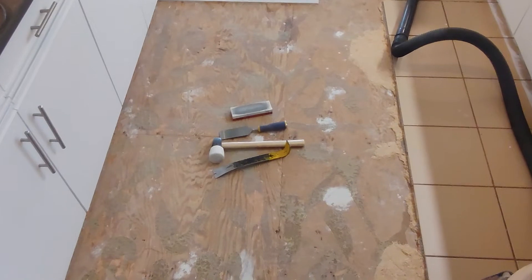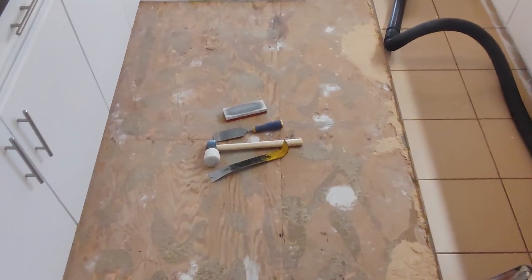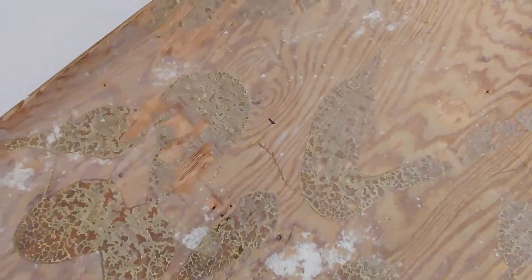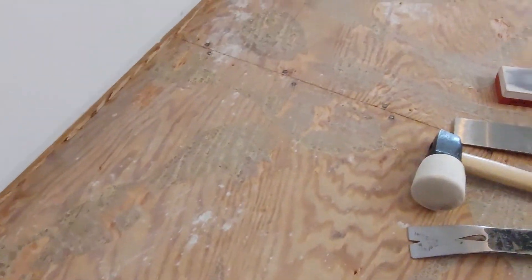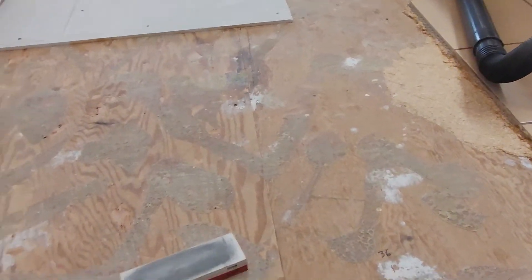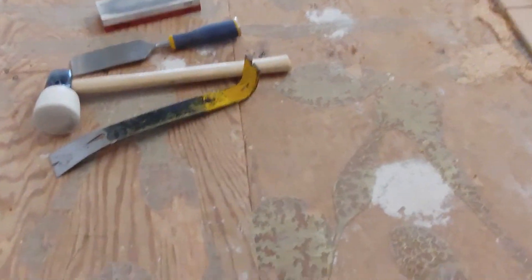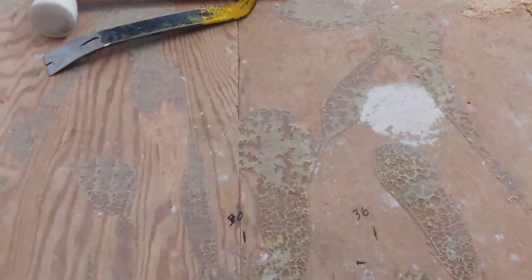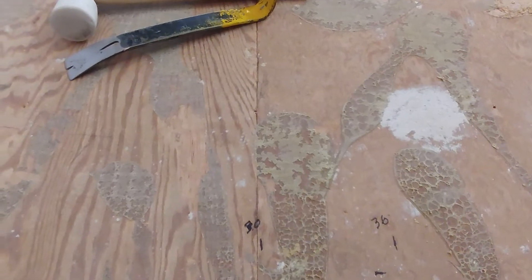It's far slower but it works well, and you can see here if you look at the subfloor — here's a spot where the subfloor was damaged or got pulled up — but for the most part the subfloor is quite intact. After I just run the chisel over it one final time to take up any glue bubbles, it's flat enough for the purposes of tiling.